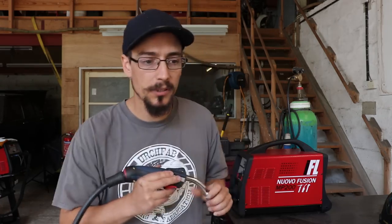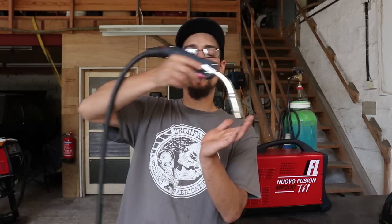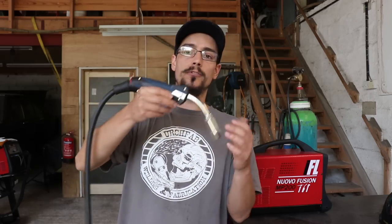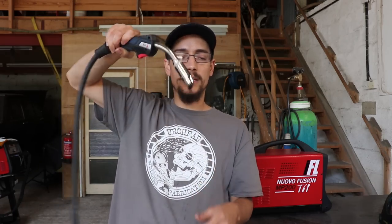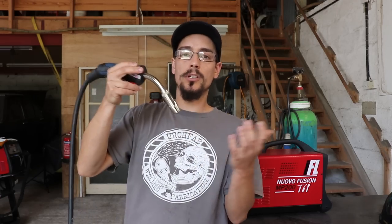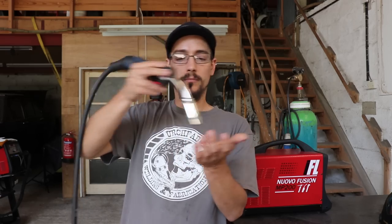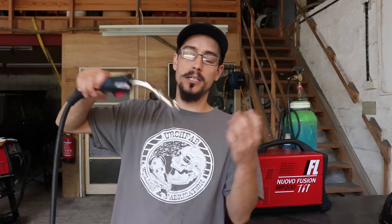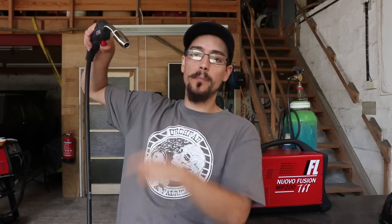And if you're building yourself a roll cage or a chassis, you can't only do one direction of travel. You can't only do a push, because you might not be able to get your torch in when you're working in tight little spaces. You've got to be able to do all different directions of welding, because you might be in a tight gap where the only way you can actually see what the puddle is doing is to pull it back towards you.